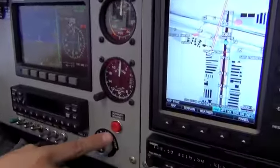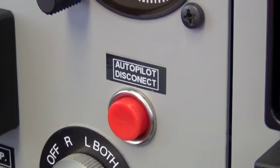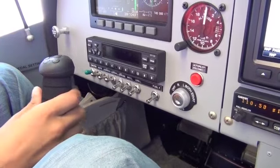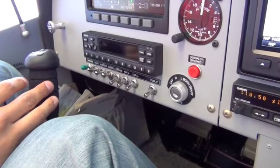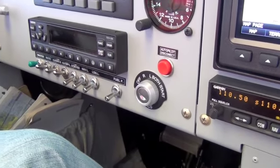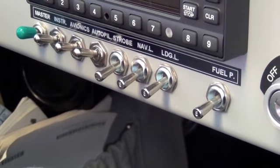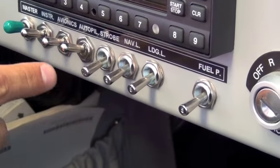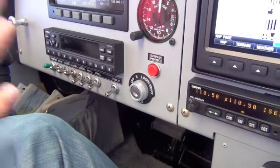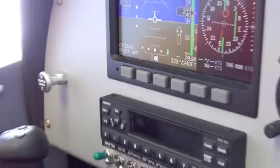One other thing: this Autopilot disconnect button. If you hold it down for about two seconds, it'll disconnect the Autopilot, and you'll hear 'autopilot disconnect' in your headset. With the Autopilot on, it's very easy for the pilot to override it — it doesn't take much muscle. But the best way to turn it off, say if you hit turbulence, is to hit the Autopilot disconnect switch rather than the Autopilot main switch. Remember those gyros that need to initialize? If you turn the main switch off and then want to turn it back on in bumpy air, the gyros won't stabilize properly. Just hit the disconnect and the gyros will remain initialized and stabilized.